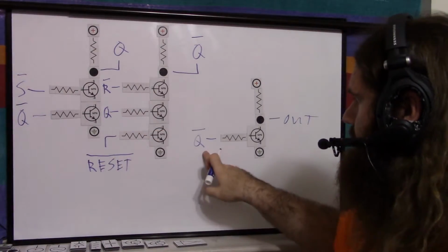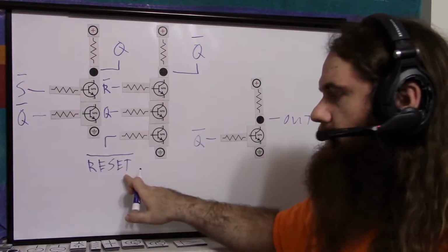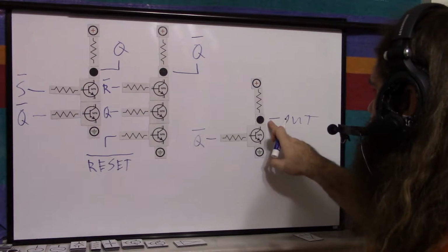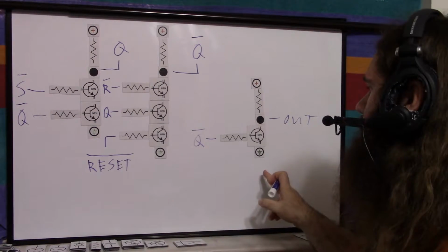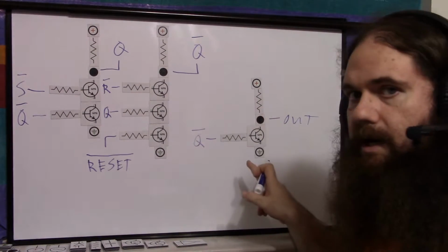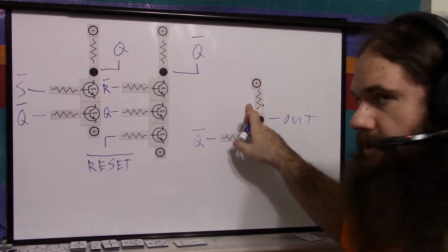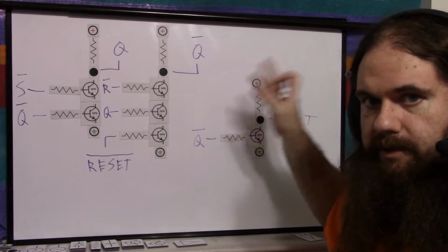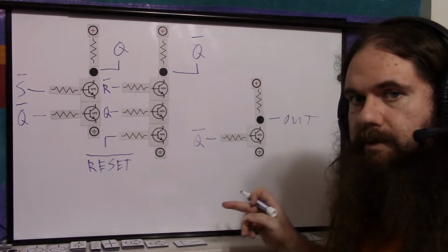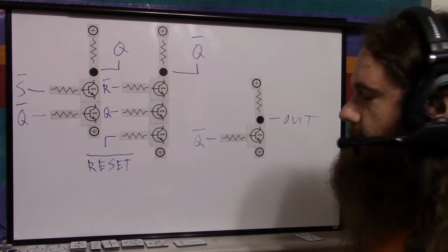So if you just do this with the Q0 signal, because we can't use Q, because Q would be invalid if S is low and reset is low, which could occur, but Q0 will always be correct. So we invert Q0, there's your output, you get the correct answer, but you have uneven impedance. So if the output is high, then it's going through this resistor, and if the output is low, it's not. And, you know, standard inverter, you don't want a small resistor here because you'll dump a ton of power whenever Q is on and you're getting a low output, because it's basically a pull-up resistor. It's just the transistor with a pull-up resistor on the output.